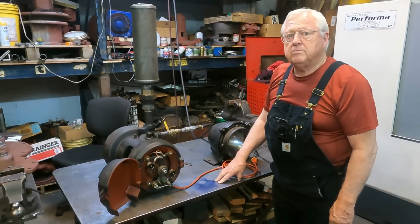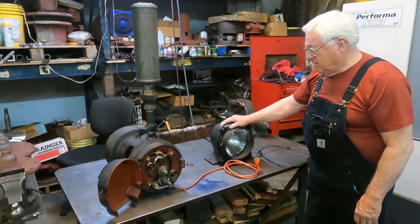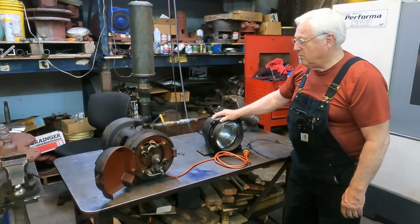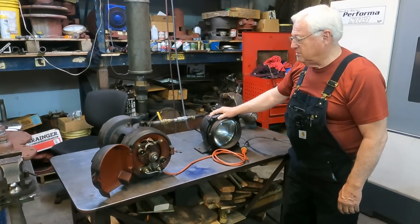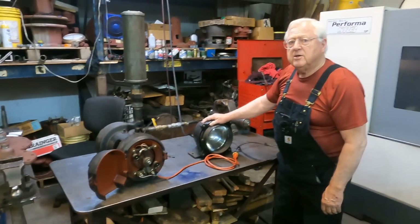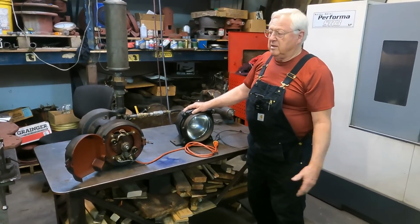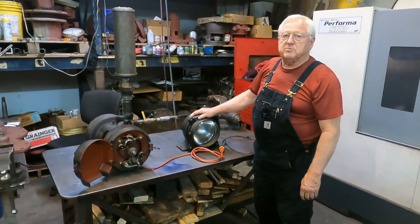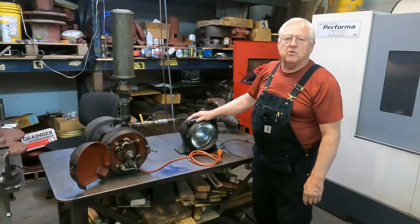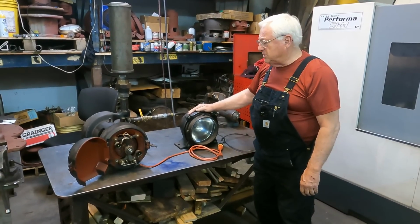So this basically just made the electrical power for lighting and stuff. You think about modern diesel electrics making electricity. We didn't have electricity on the steam engine, so this is where they would power their headlights and stuff from. Right. And what was the voltage? 32 volts, which is DC, direct current. It sounds odd today, but that was standard on locomotive stuff, on every steam engine that was built up until the late 40s, when they started doing different voltages. 64 was another common voltage.